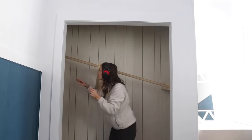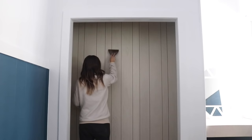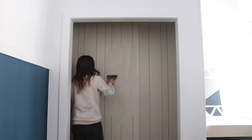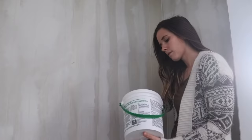When that was finally out, I filled all the lines in the wood paneling that covered the walls inside the closet with drywall mud. I've done this before and prevented it from cracking, and here's how: you don't want to overfill the first time, and you want to use an all-purpose mud instead of the fine finish stuff. I fill one coat of mud in all of the lines, but where the paneling ends and meets another panel, I first fill with a bead of caulk and then drywall mud — so that prevents the seam from cracking as well.